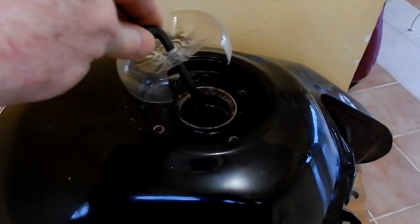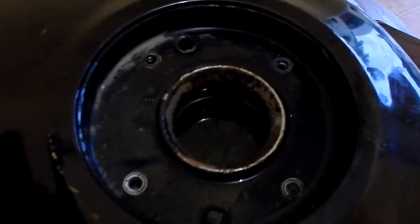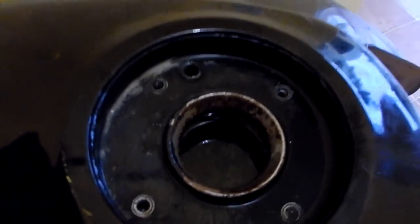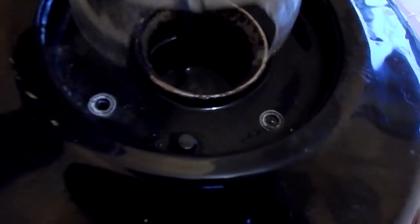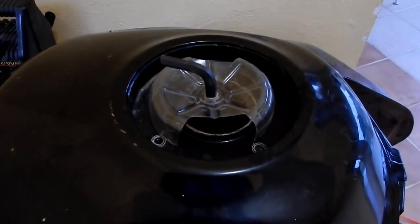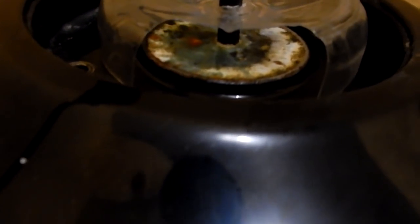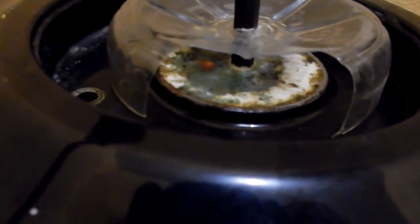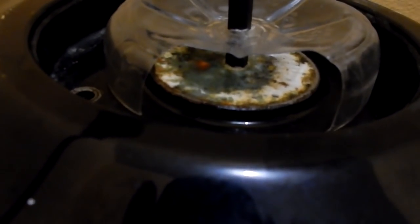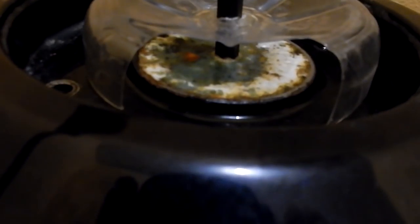It's only been about 10 to 15 minutes, but I wanted to clean the anode and the muck from the top of the tank so you can see the reaction better. That's what I just finished doing. I cleaned the anode off and took out the surface crud, just put this back in and turned the power on maybe 30 seconds ago — but you can already see the bubbles forming. That's all hydrogen gas, and you can see more rust floating to the top, so so far this is working as planned.